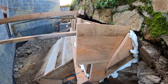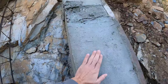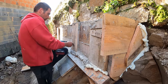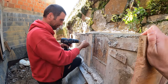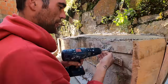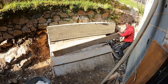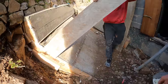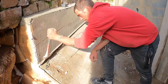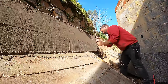Back here, we've got the bottom base part filled. And this is the top lintel area where we have the cage in place. Our forms are looking great down here. The nice thing about taking the formwork off earlier is that you can still shake the concrete a bit, snap it off a little bit.